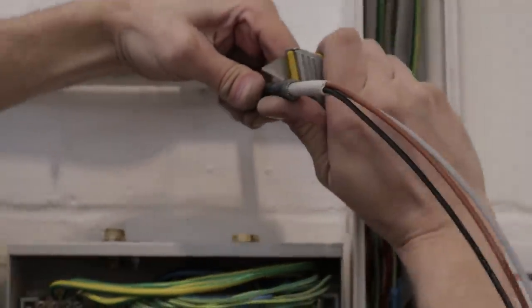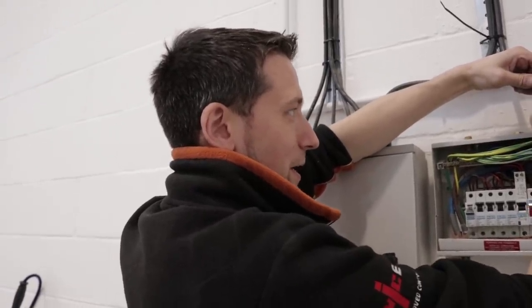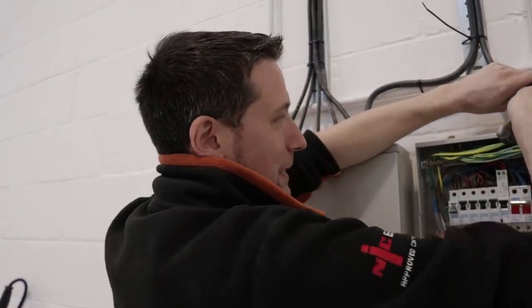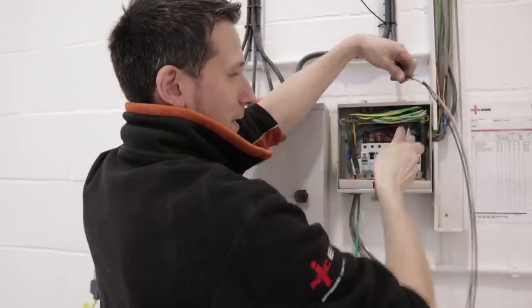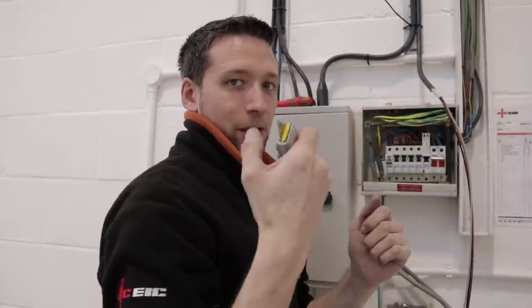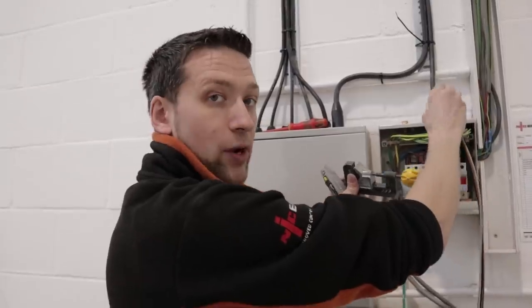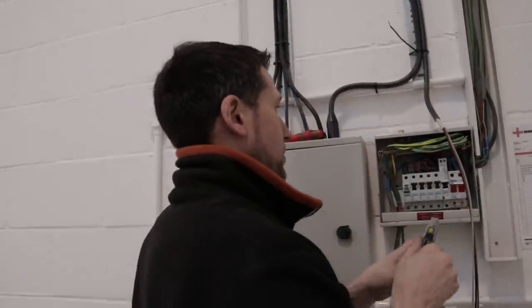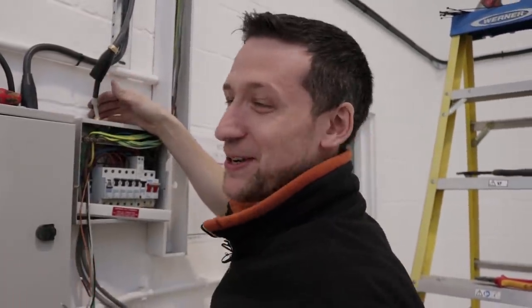Many a time I've done that where you're doing this with a knife — it's just one of those things, an experience thing. Electricians always have cuts on the inside of their fingers because you're just stripping cables and all sorts. When you do that with armored and you're twisting it, I've done it before where you've slipped and cut your finger. You can actually use that tool according to the instructions — just scour it until you can hear it touch the metal and you've cut through it. Or just use a hacksaw. Doesn't matter how often you do it, you still make mistakes. Spot the schoolboy error I've just made — won't take you long.